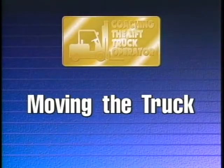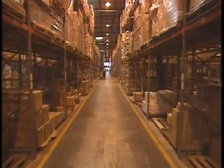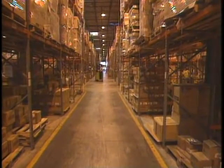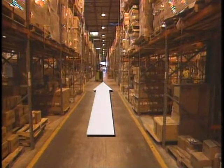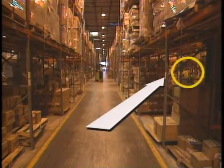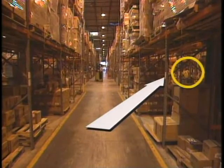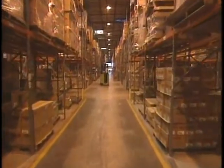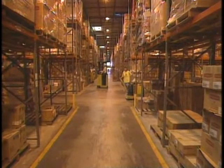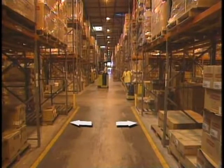Moving the truck with or without a load. While moving, the instruction 'scan in the direction you are going' may seem simple, perhaps too simple. If you are only scanning ahead, spotting the oncoming truck, you are only doing part of your job. Other workers, walking or using other equipment, may be coming at you from various angles. Experienced operators have learned to glance quickly through racks when coming to an aisle intersection, blind corner, bins, or offices for other material handling vehicles and pedestrians. These operators reduce their speed and proceed with caution or come to a complete stop. You should be alert and ready for the unexpected. Also note that this operator stayed in the center of the aisle to get the best view to both sides and to allow equal maneuvering room on either side.